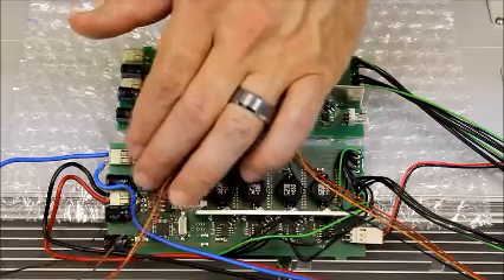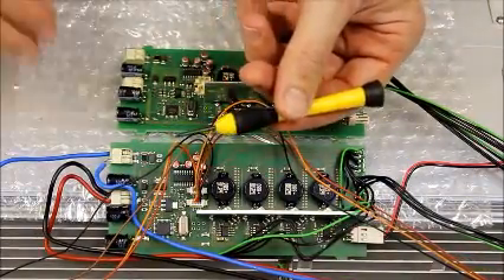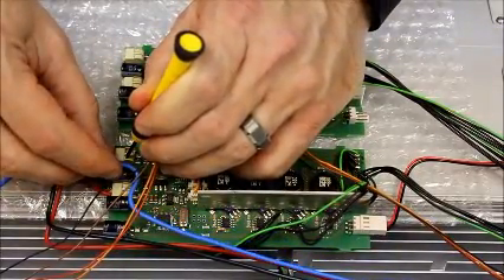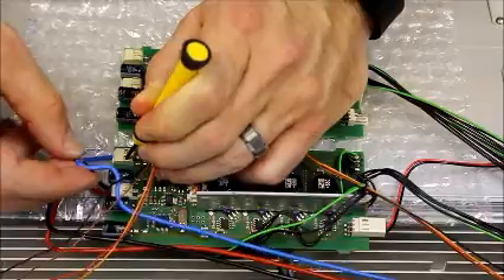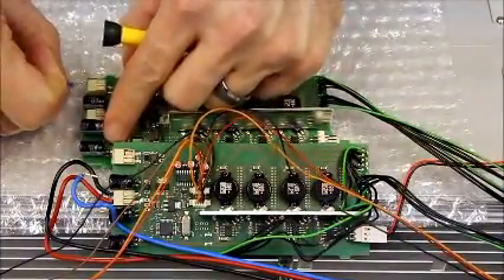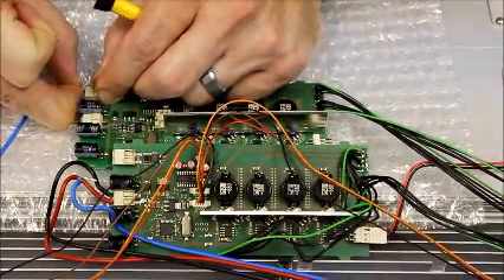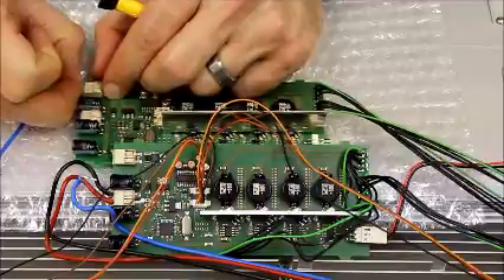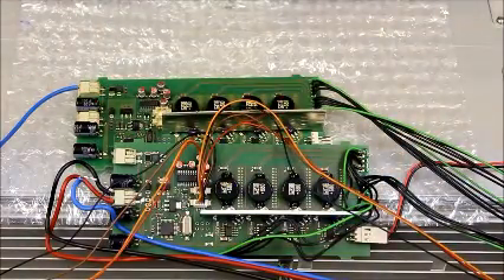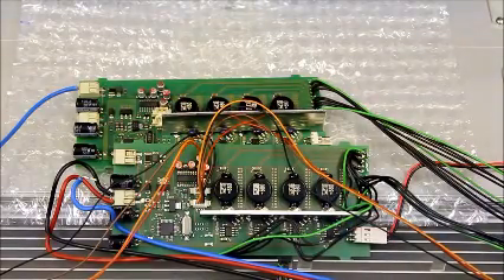One point to note: these connectors are a little bit difficult to remove the wires from. You'll need a small flat-bladed screwdriver and you need to press on it really well to get it to come out. Some come out a little bit easier than others. Once removed, take the wire and move it over to the first connector on the new KSQ. Make sure to give it a little tug to confirm it's in there well. Do one wire at a time to avoid any confusion of potentially swapping wires, because if they're not put in the exact same way it will cause the fixture not to work correctly.